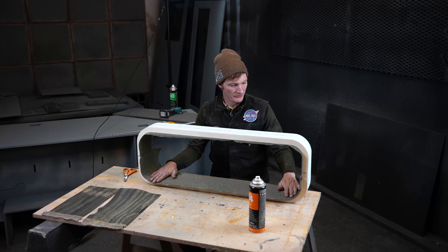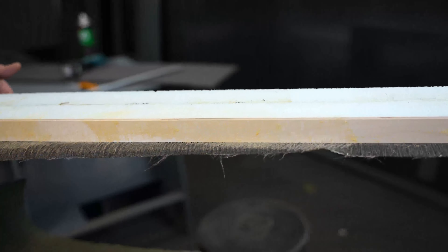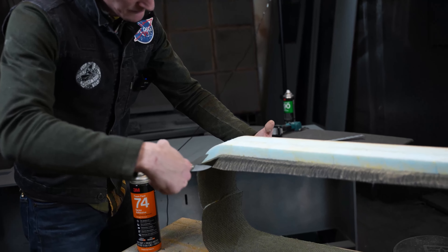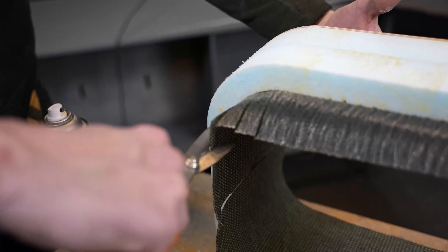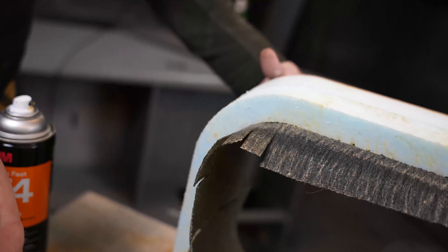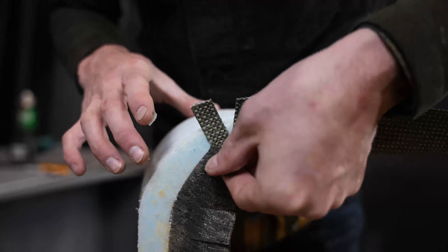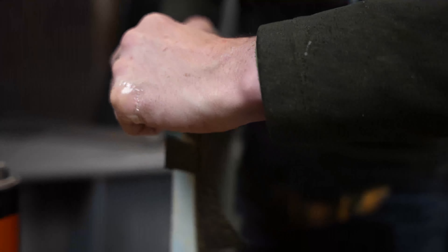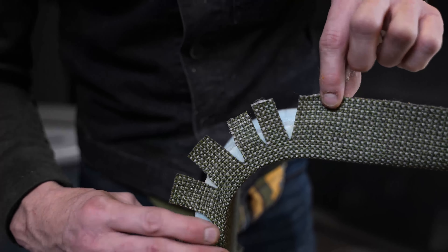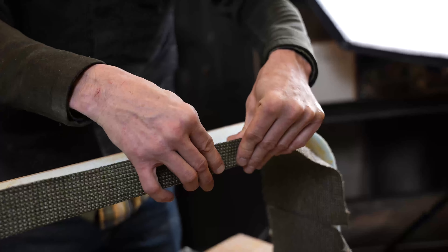Now that we've glued down our main fabric, we're going to move on to the edges. Get your glue again and apply it to the face edge. Once we've applied our glue, we will cut some relief cuts into the corner — I like to do maybe four relief cuts there, about three-quarters of an inch on each of those flags. Once you have your relief cuts, start at one edge of the corner and pull back those flags. This FoamFast glue is very strong, so it should just stay, leaving a little fringe. Carefully move around the frame, pulling your fabric taut as you go.